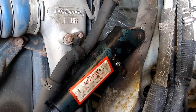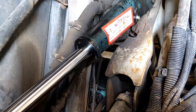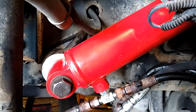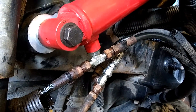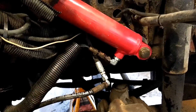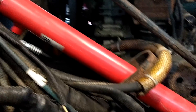This is the upper mount and the safety catch and the guard there — if that helps the leg getting crushed if you have it the other way, tilted more toward the frame and it starts coming down. This is the passenger side mount with the shoulder taken back. The lines are hooked up; had to re-plumb this a little bit differently from the original. On the driver side, basically reused the lines over there and just put a 90-degree fitting in there. I still have to tie the lines back.